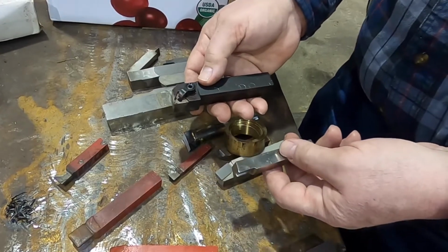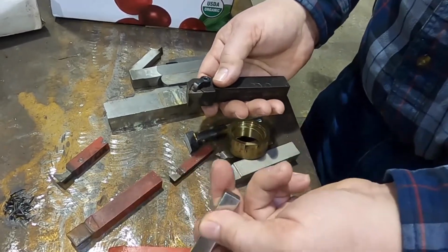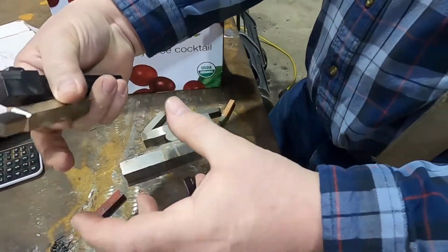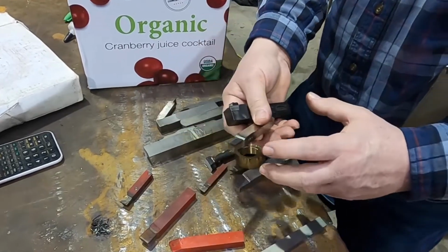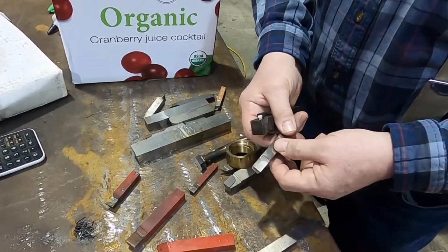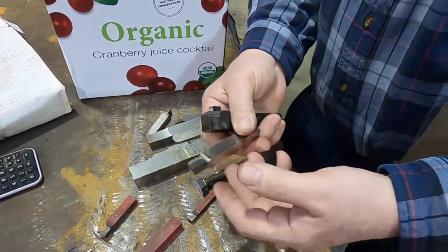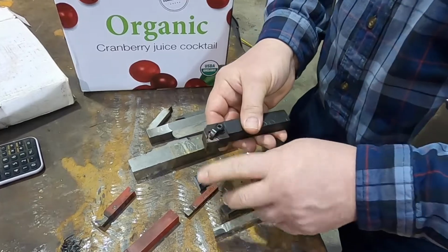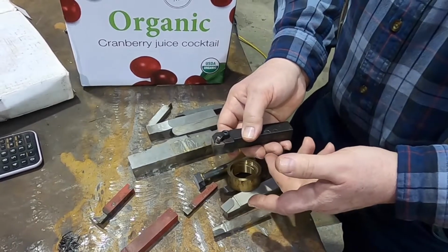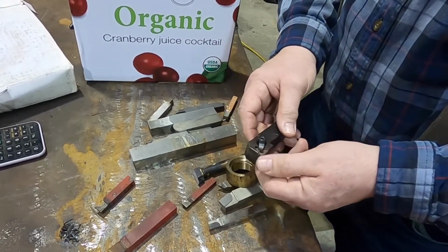Very, very helpful. Although sometimes to get into a place due to the way a CNC machine is made, you'll go back to braze-on tooling, because all the different parts of the tool, the machine moving around, you've got to have this sub spindle close to you, something else near, and you want to get in to make a little cut without stopping. Well, you go back to a brazed-on tooling sometimes, even with a CNC. But you have more problems with setting it up. It's harder to set it up. It's harder to deal with. Where when you can go to an insert, anytime you can do that for production, one-off, it doesn't matter so much. It's more a matter of just, this is a one-time tool and this one's renewable.